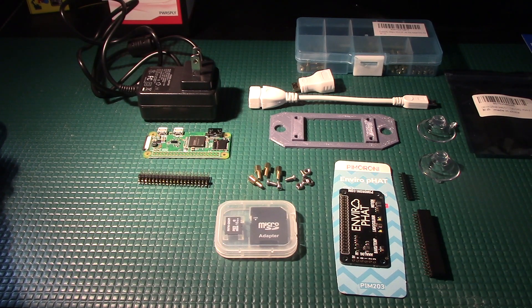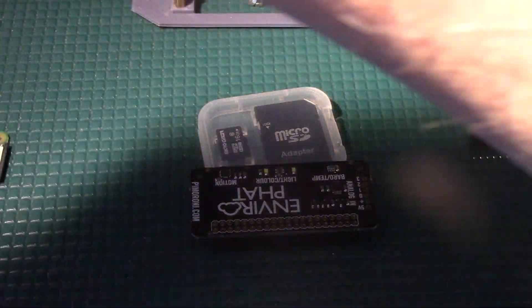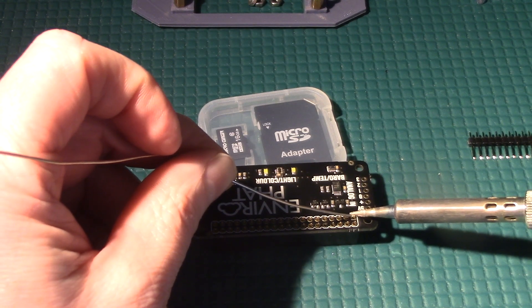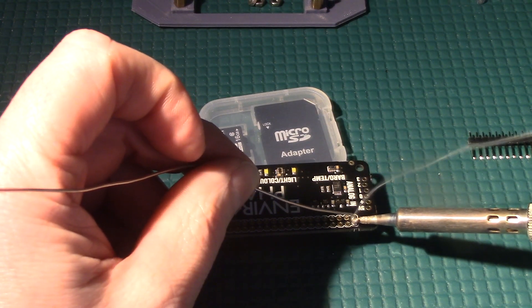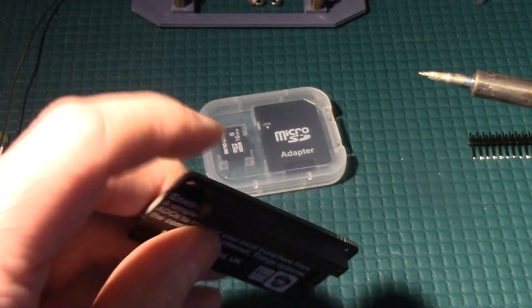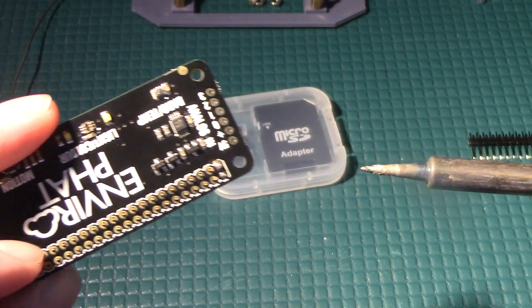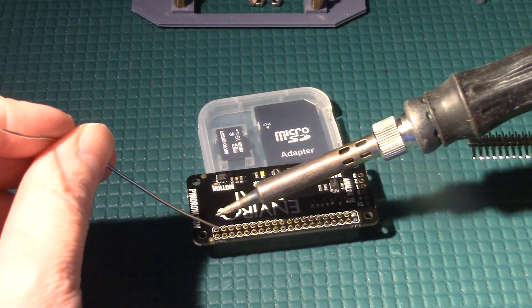So that's everything we need for the project. The next thing I'm going to do is start soldering the headers onto the Raspberry Pi and the P hat. Now we're ready to solder the headers — we have to solder the headers on the Enviro P hat board and on the Raspberry Pi. I can't claim to be an expert at soldering — I'm more of a software guy than a hardware guy, but I kind of fake it. The first thing I always do when putting these headers on is make sure it's aligned properly. Get the first couple of pins in, make sure it's nice and even, then check out the solder joints — I usually have to use a magnifying glass. I'm just going to speed this up a little bit and crank through all 40 pins.